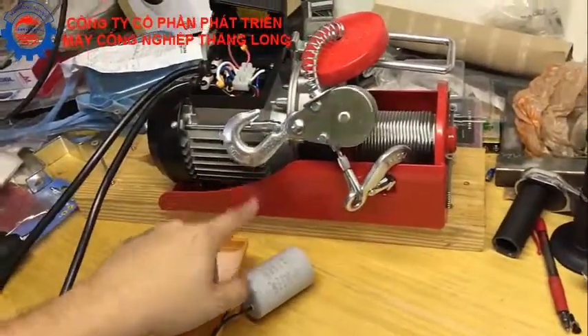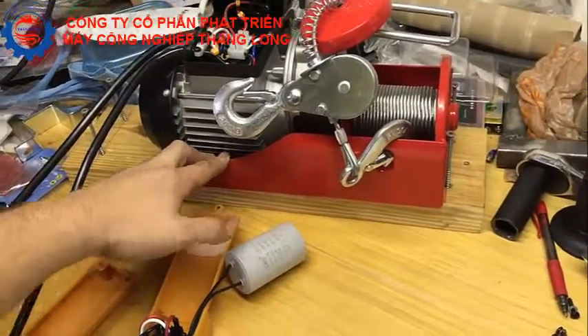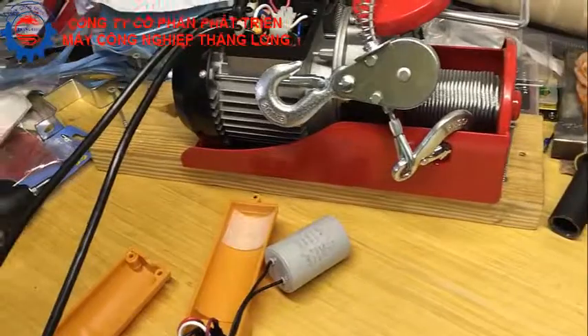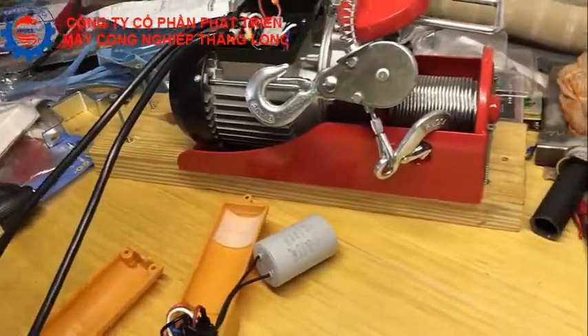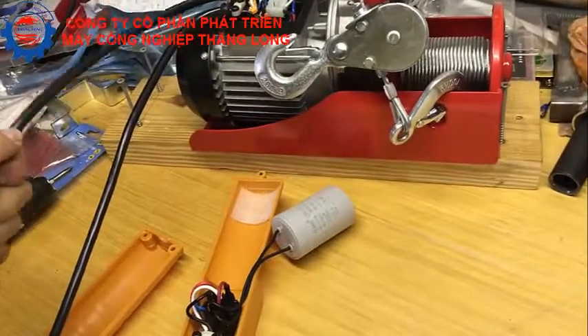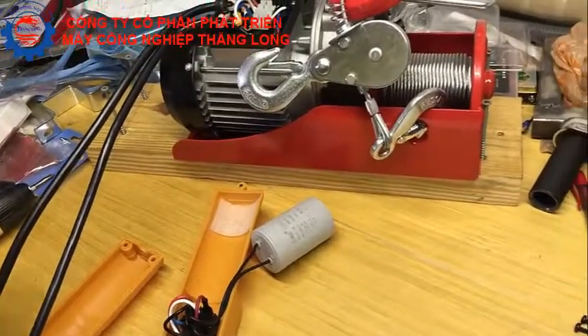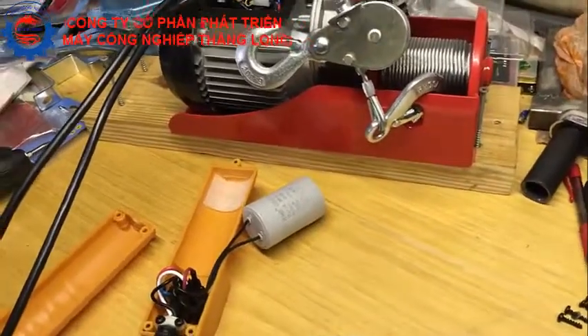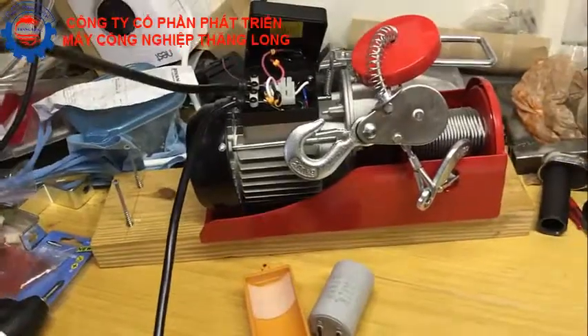The one that comes with the 220/440-pound electric hoist — the cheapest one, about a hundred bucks — comes with 18 gauge, 4-conductor cord. I went ahead and got 16 gauge since I'm extending it. This is not just a control line; you have full load coming through it.